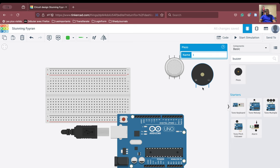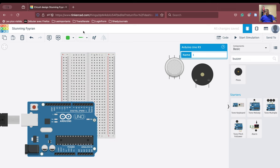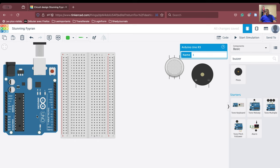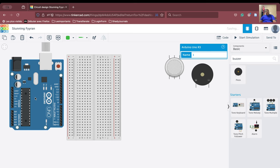Now we are going to connect. First of all, we will rotate the breadboard so there is a convenience of space. We will put the Arduino here and the breadboard here. Now let us understand the gas sensor — it has A1, H1, and A2 on one side, and B1, H2, and B2 on the other.